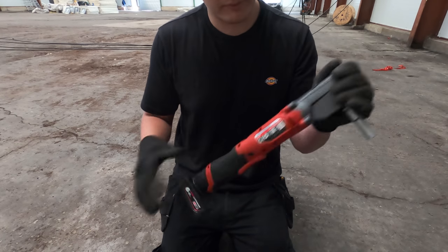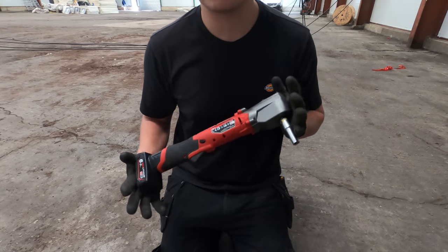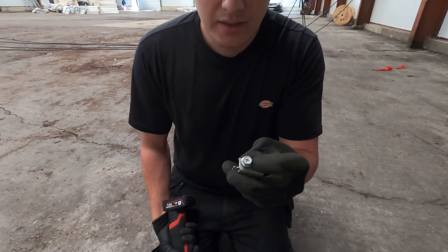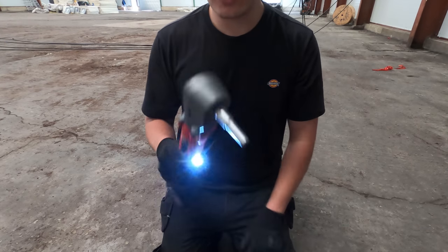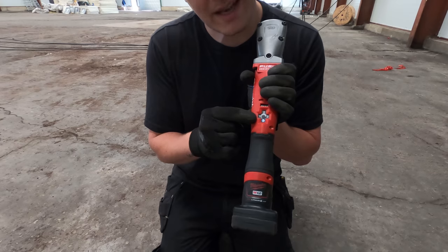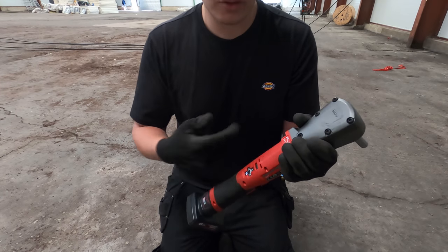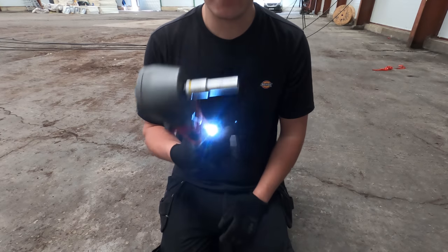We're going to be doing them up with the 3/8 inch impact wrench from Milwaukee. I got this and everyone said what are you going to use that for? But honestly, I use it all the time — as an angle drill with an adapter, and for stuff like this. All over these are PZ2 bits that just shear off. With these you can get a nice solid fix in. It's got three speeds, plus a fourth anti-strip mode — it starts off really slow and as it feels the nut loosen, it increases the torque and slowly rips it out. It's a real nice tool.